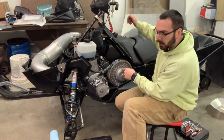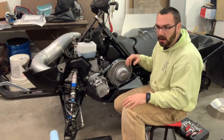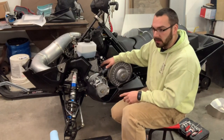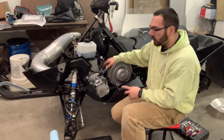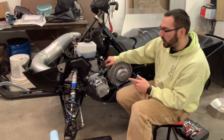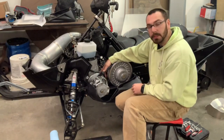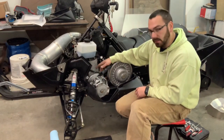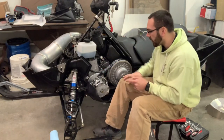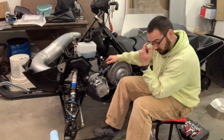With the screwdriver holding the pump wide open and revving it up, my concern was — after I did that, I noticed that my lines going from the pump to the carburetors were full. I had run it probably five minutes the day before, but when I came back, I noticed the PTO line wasn't full — wasn't bled all the way. I got a flashlight down in there and saw oil in the line but it was still about five or six inches away.